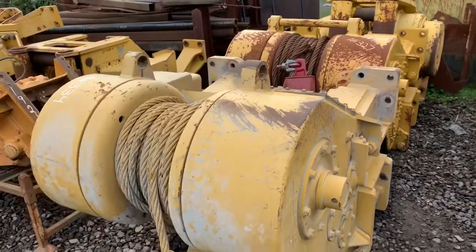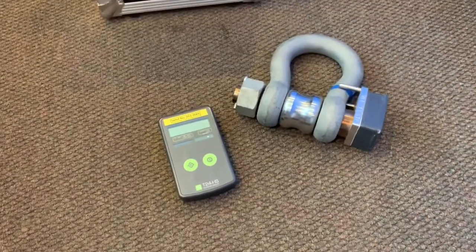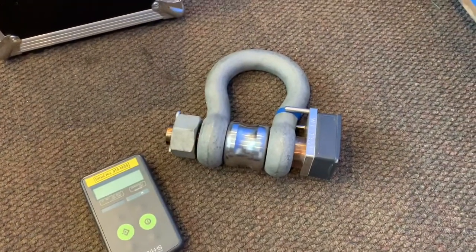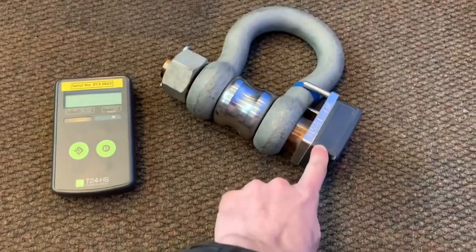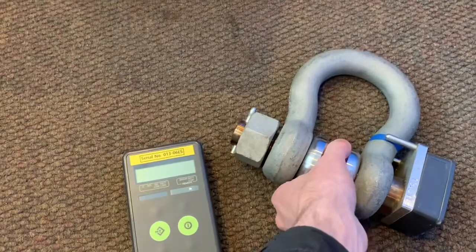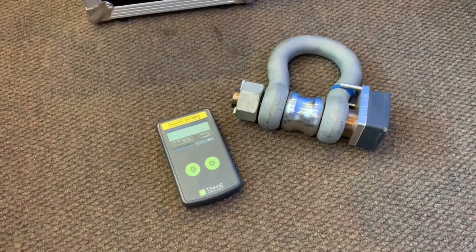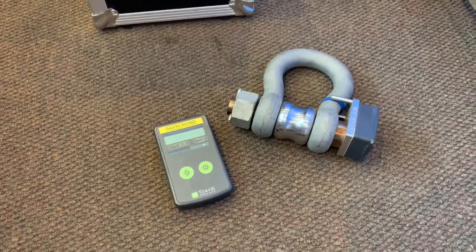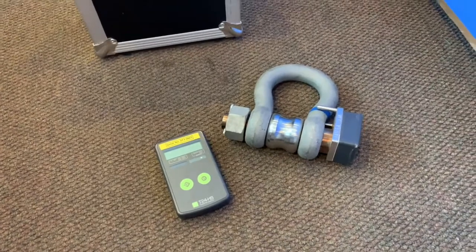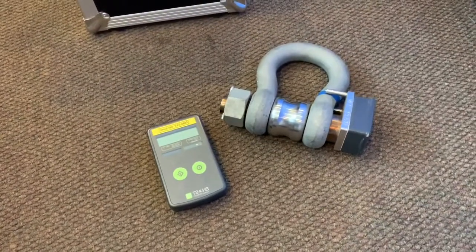We have a suggestion. This is what we call a smart shackle — you might have seen them before. Basically it's a shackle that goes on the end of the wire rope. It has a wireless transmitter that goes to the operator in the cab, and you'll get a display showing how much load is actually on your winch. So you'll know: is your hydraulic winch performing to its full capacity? Is that hydraulic motor and pump combination giving you the full near-140,000-pound line pull? On the PTO winch, this indicator gives you a gauge of how many thousand pounds or tons you have on the line.